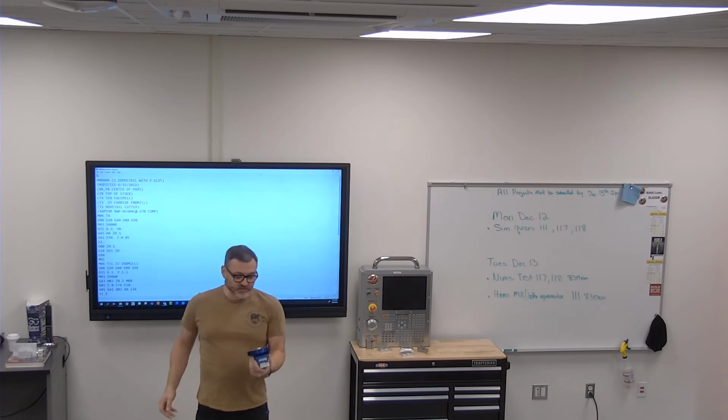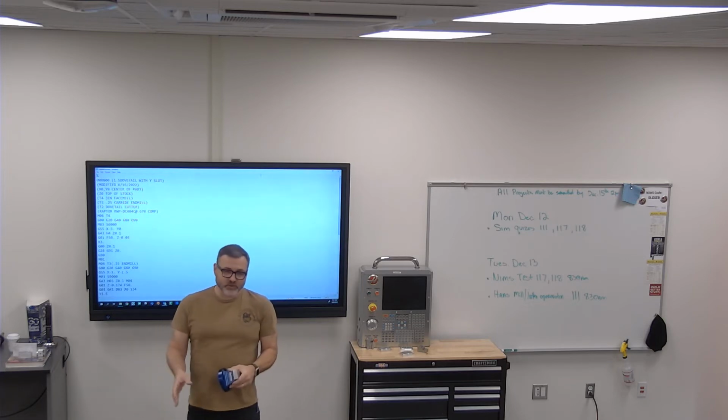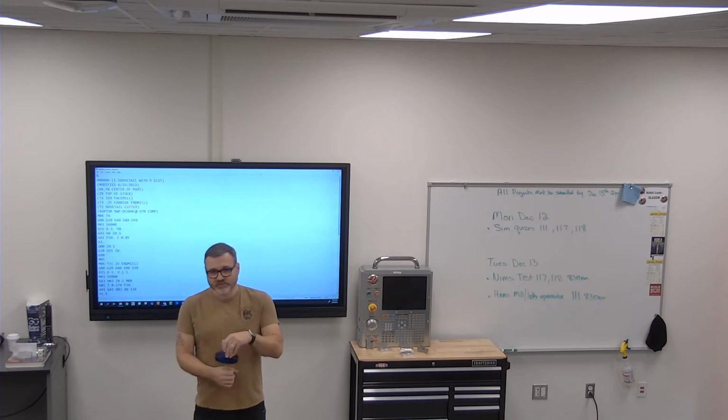So I had students a couple semesters ago, they bored this hole in the table and then they drilled and reamed this hole in the table, and almost all of them did it wrong. So some of them have bushings in them. Some of them you'll have to set down in there and indicate in. Some of them you'll be able to just drop in and they'll be perfect. But you're gonna have to double check every single machine because everybody, I said, you gotta bore this hole, not ream this hole. Well, if you ream the hole, you gotta ream the hole really slow.